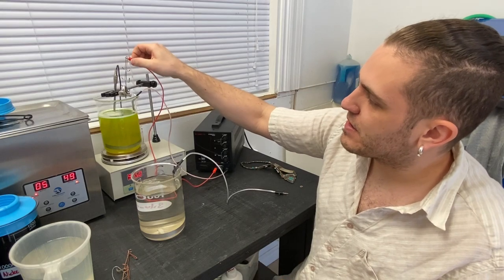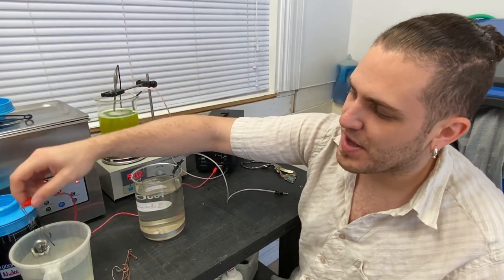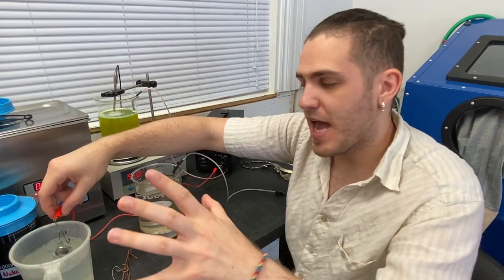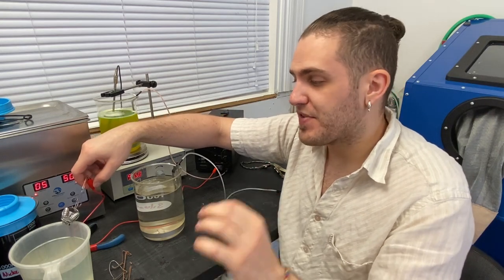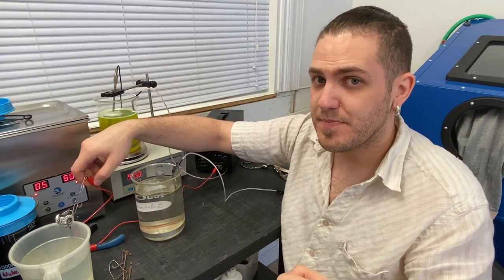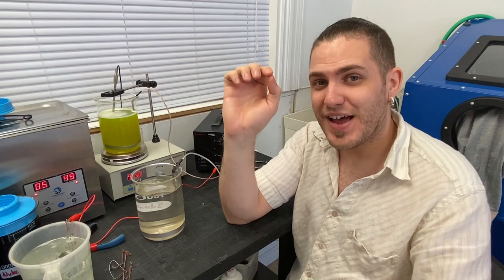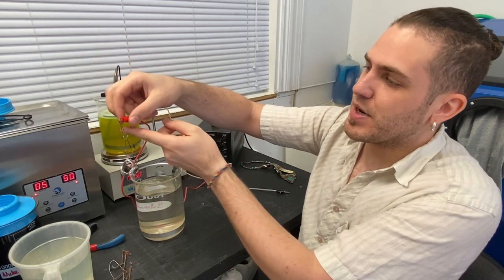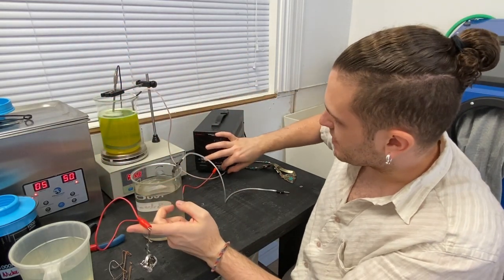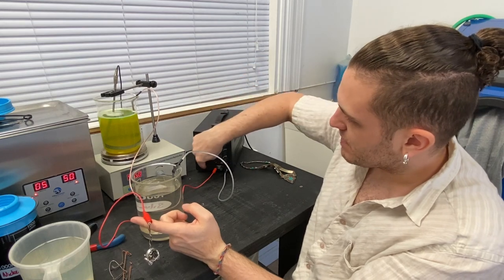Once it's done cleaning, turn the power source off, drain any extra solution — in this case there's a big empty cavity inside — and rinse it off in water so you don't contaminate one solution with another. Bear in mind you need a different water rinse container for every single solution to avoid cross-contamination. I'm going from TevaClean straight into the silver solution so I just have the one. Now I'm going to switch the anode from the Teva setup to the stainless one in the silver bath and turn that on.